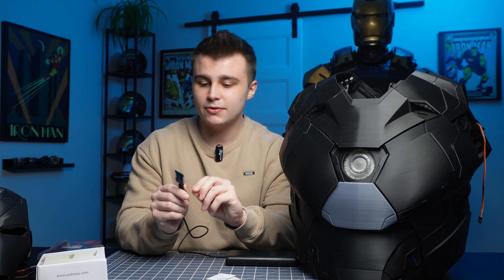On the other end I have another ESP8266 module connected to the power bank, already configured with the correct code, communicating to the other board via its MAC address. It has a super great range — I could be outside right now and it would still trigger the chest. Let me just connect this wire from ground to digital one, and there you have it. Right now about half of the servos are detached — not turned on — I have one turned on with this panel just to keep it in place, same with the other panel, but these ones right here are completely turned off.